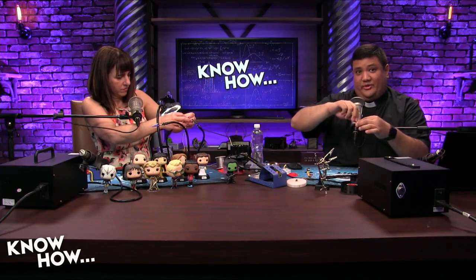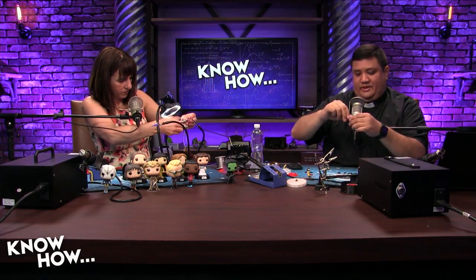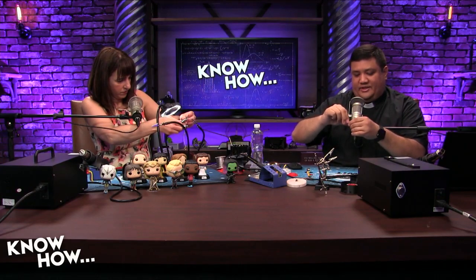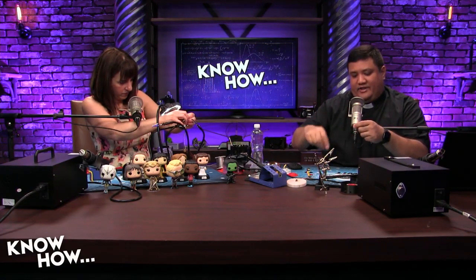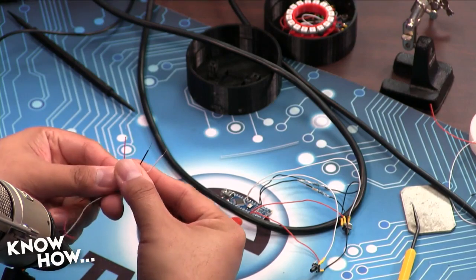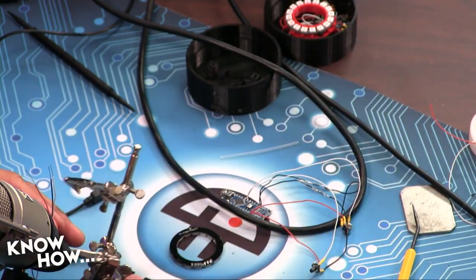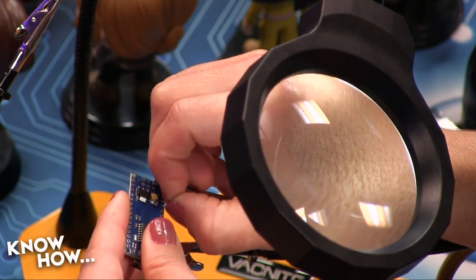And then with all of these wires, what I should be doing is tinning them after I strip and twist them. But I'm not going to do that because we're a little time limited. And, well, I do want to show you this working. Because it fits into the enclosure. We know that with the prototype. But we need to make sure that the electronics are actually going to function properly. And actually, you know what? I lied. I'm going to go ahead and tin these. That's my OCD cropping up. Mine's not going to be done by the end of the show. No, that's fine.